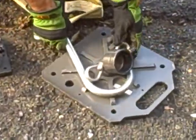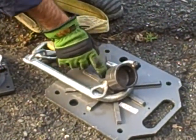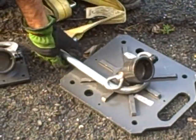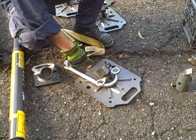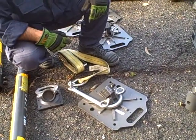What we've been doing for the guys this last week — that's how I want to see them. Go around the base; you're transferring the load through the hard part of the base, and these eyelets, these winglets, are just to help prevent this thing from coming up your strut. Still slightly side-loaded, but we're side-loaded on this steel versus that cast, so it's going to be a little stronger.